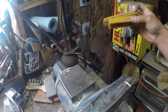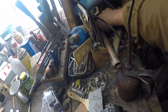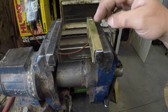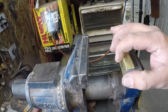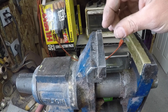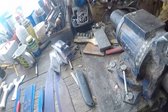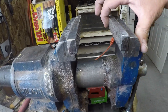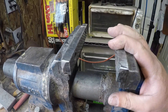I don't really use the rubber jaws a whole lot. I also have a piece of copper or brass sheet that I bent at a 90 degree angle so it's got a lip. If I want to grip something and not mar it, but grip it harder than the rubber ones allow — because the rubber ones have so much give that stuff can still move — these brass jaws work really good. I've heard of guys making soft jaws or recutting the serrations, but honestly the ones that are there just work just fine.